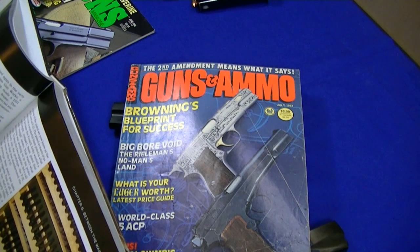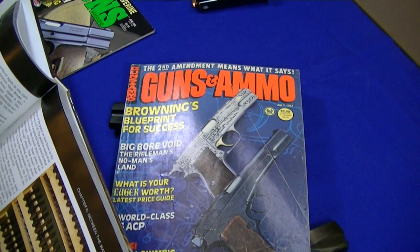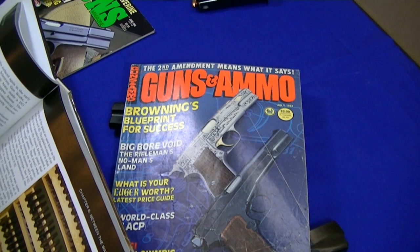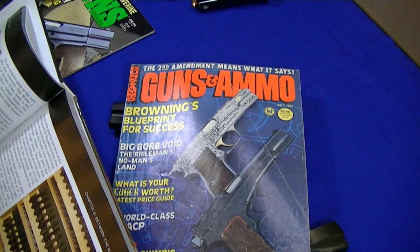Okay. To take them in order of the most interesting, the Savage breech block is a self-contained unit that holds the striker, the hammer that is linked to the striker, and the sear. The trigger mechanism links to the breech block when the slide is closed. When the slide cycles, the breech block is removed from the trigger linkage, the act of cycling acting as the disconnector does on a 1911.